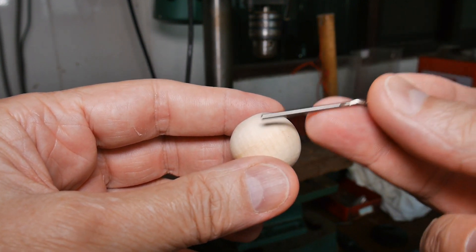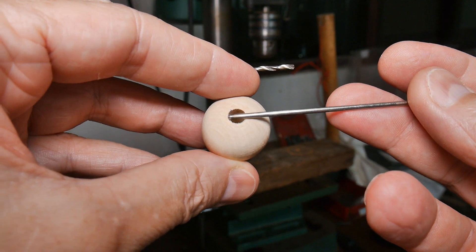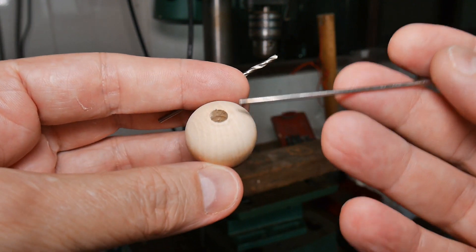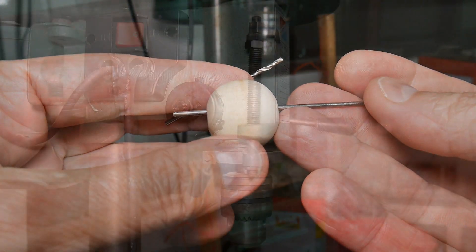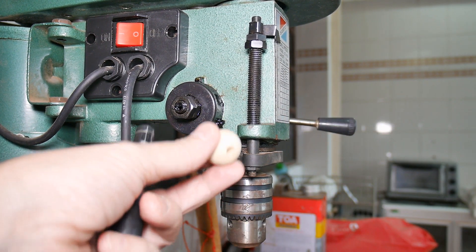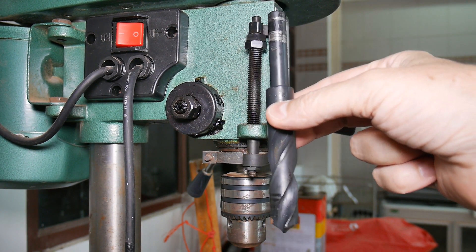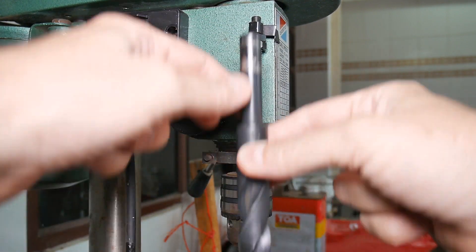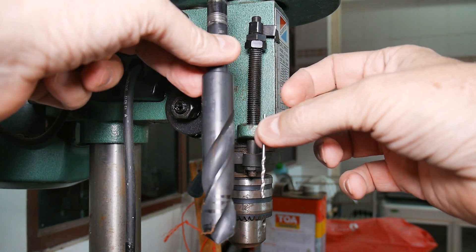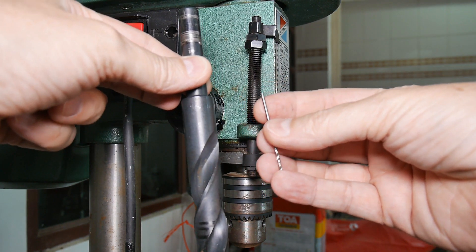I've got to drill this ball with this drill bit to mount this shaft in here, and I don't have the best drill press, so I've got to kind of make do with what I've got. I'm going to go through this and see how I'm going to do it. The usual trick is making an indentation in a board, setting the ball in it, and then drilling the hole through it. However, one of the problems is the travel on my drill press — after I get done with the indentation and try to use this drill bit, I'm going to have to move the table, which means they're no longer aligned. So I can't do the usual trick like I could with a thousand or two thousand dollar drill press.